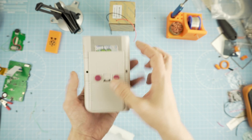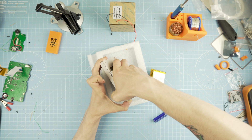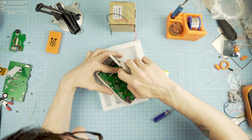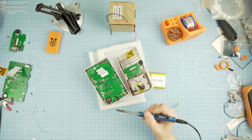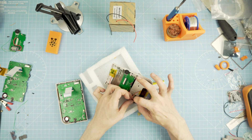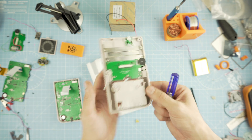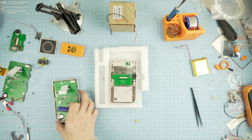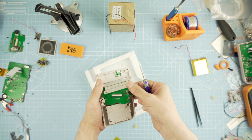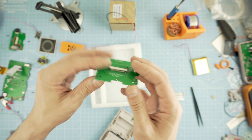The first thing we need to do is take the case apart. Just unscrew the six screws that keep it in place, and with a plastic card apply it around the edge and it should just pop out very easily. Be careful — the ribbon cable that connects both sides of the case needs to be removed as well. With both sides apart, I'll need to remove the booster and Qi charging to proceed with the mod. Let's start with the back part.